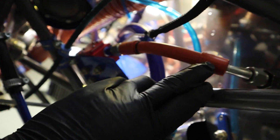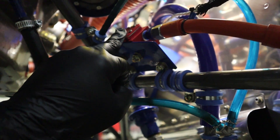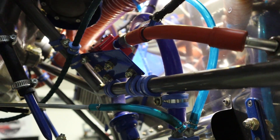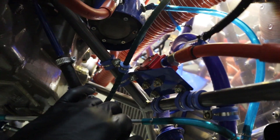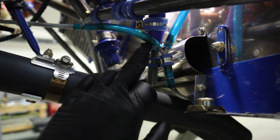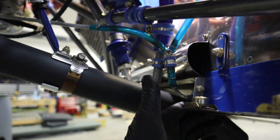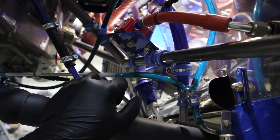That fuel line running from the firewall up to here is the fuel flow meter, and then it goes into the other side of the fuel pump. This is your throttle cable running up to the right side of the engine. There's also a fuel drain coming out from the bottom of the engine from the back of the fuel pump — it's tied off and dumps overboard. There's usually just a little bit of fuel sitting in there after shutdown.